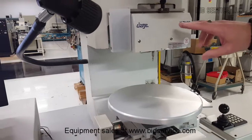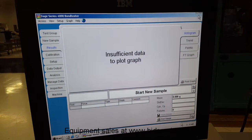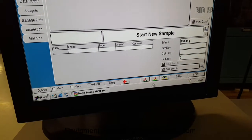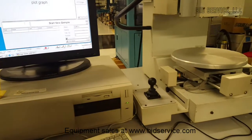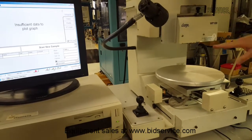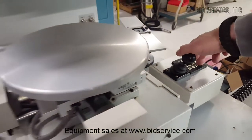That's because the lower limit needs to be set for the puller. This can be done two ways. One: maximize your application, and you'll see on the bottom of the screen a hook with a green bar below it. Press on that and pull the Z joystick down at the same time — the device will go down. As soon as you let go of the button, the machine will consider that to be the lower limit. You can also do the same thing with the arrow key on the keypad — press the key and set it to its lowest limit.